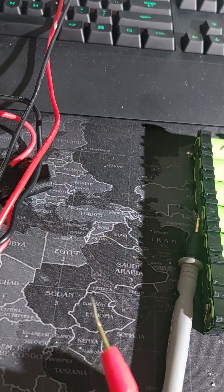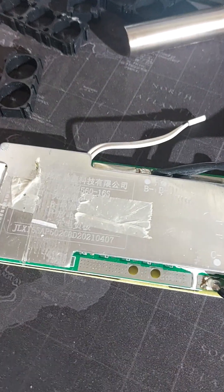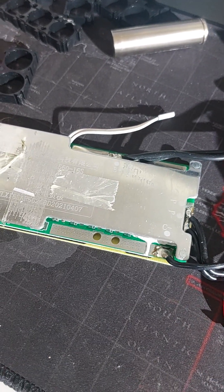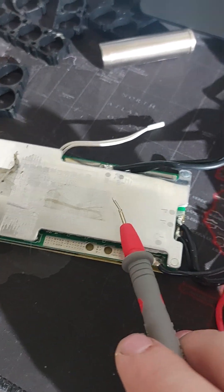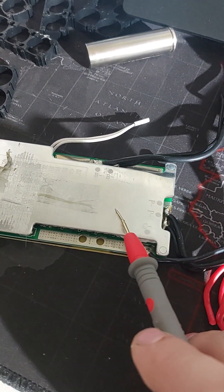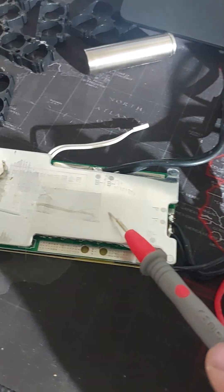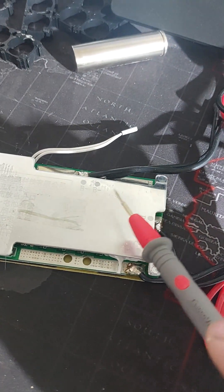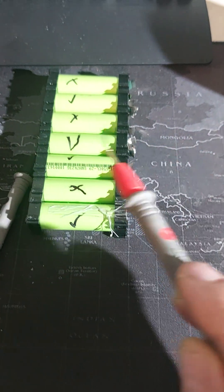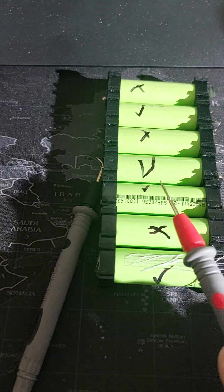I'll show you why. When people talk about resetting a BMS — which is inside the battery, connected up to all the battery cells — supposedly being able to reset it isn't necessarily the answer. The purpose of this board is to control the flow of current and power coming in and out of the battery to the controller. When it gets down to its minimum, it shuts down the discharge, and when you're charging up the cells and you get to the specific voltage of 4.2 — or, if it's 10 wide, 4.2 times 10 is 42 volts — it'll shut off the charging, so you don't overcharge or over-discharge the cells, which is vitally important.